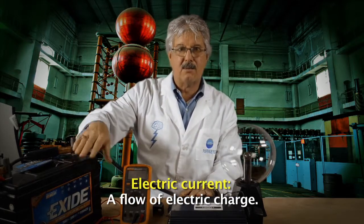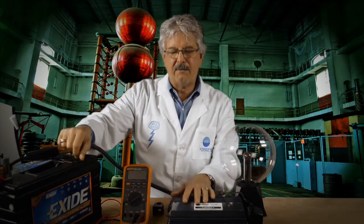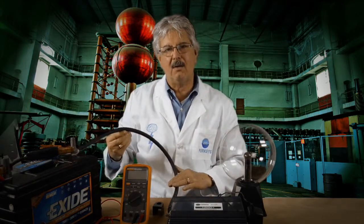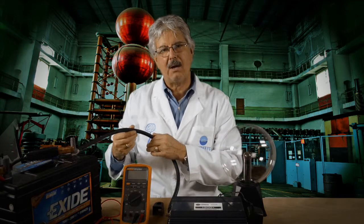It's easy for me to add and subtract. If this were a 10 volt battery and I have 1500 watts, that means I'd have 150 amps of current flowing through the red cable, through the meter, and that 150 amps of current would come back to the battery. So at low voltage, you have a real high current level.